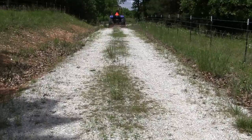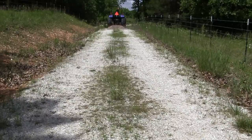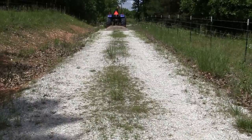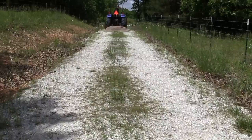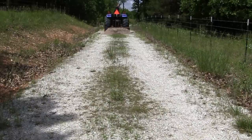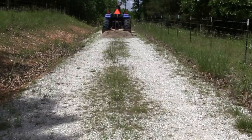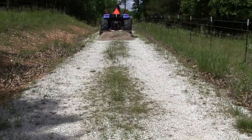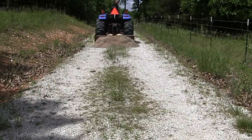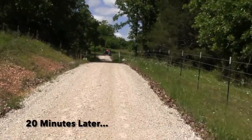When the person made the driveway, they hauled in a bunch of chat or base rock, put it in, and then over time as you drive over it, it gets compacted and pushes the gravel down where the tires hit. The center will be not that compacted, so you've got a hump or a crown in the middle. A lot of people go out and buy more gravel and put it on, and that works, but the gravel that you put there is probably still there. All you really need to do is bring it up to the surface again — a box blade is the perfect tool for that. So what's the best brand of box blade?